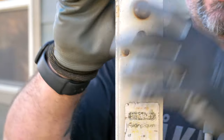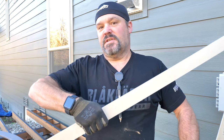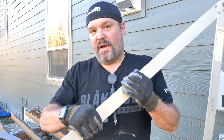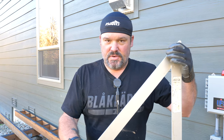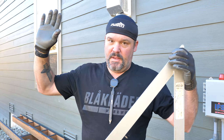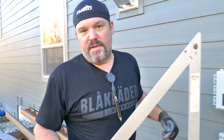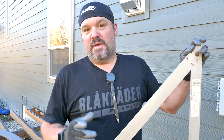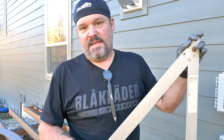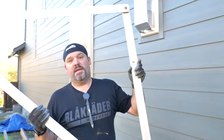You can see the arrow right here — that's how you open this thing up. You can't open it the other way; you've got to open it like the arrow says. We actually have two different versions of this: a true 45 version, and another that's more like a 3-4-5 square. I'm sure many of you have heard of a 3-4-5. You measure three feet one way, four feet the other way, and the diagonal should be five feet.